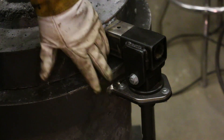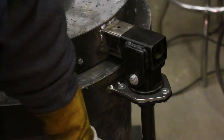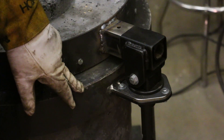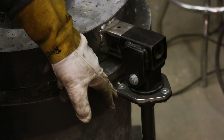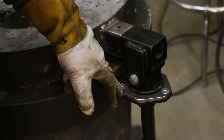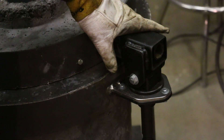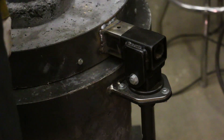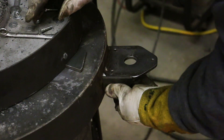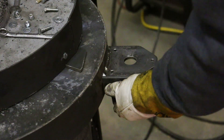I'm going to put some metal gussets on this bracket to give it some extra support. I am going to have a piece of tubing coming from the bottom down to the floor that will add a lot of support underneath it, but I still like the idea of the gussets. The problem is that this plate underneath is going to be a little tight with the gussets welded in, so I'll have to take the plate off and do some grinding or milling on the sides to make it a little smaller to fit back up underneath. I don't think that's going to be a major problem. I've got a couple of gussets cut from metal — we'll weld one on each side and that should give a lot more strength. I'll tack them in place and then weld them up.